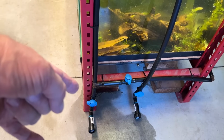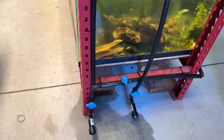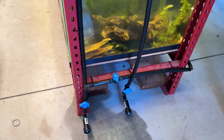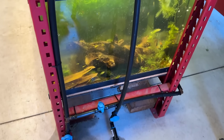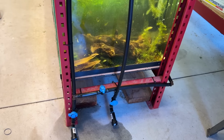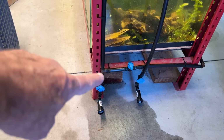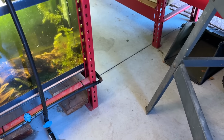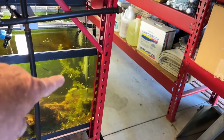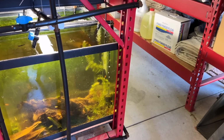And then the same thing with the outflow valve. If I didn't have that one, it would drain everything up to the valves. So this way, everything stays relatively charged. And ideally, no more air in the lines afterwards. So now when I plug in the garden hose to the outflow, I open that, then I open that one, and that drain, and then I can open these valves on the bottom side one at a time and drain the tanks one at a time.